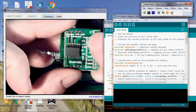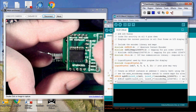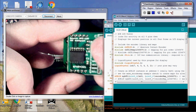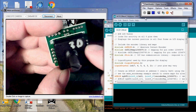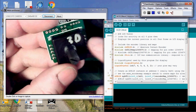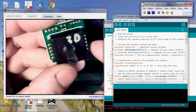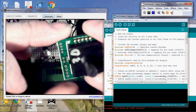Over here there's the teensy-weensy little address jumpers, which will be bigger in the next batch. You must connect all three of these to something. I ship them with a random number picked for each one — this one is 3D. They're all going to be between 0x38 and 0x3F for the A chips. That's the device. It's very compact; it's not much bigger than the device itself.